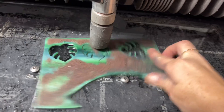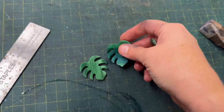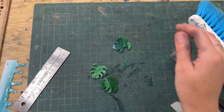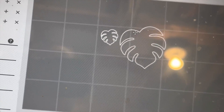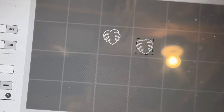These cuts are exactly what I wanted at this scale. The hole is still a little weird though, and I think I want to move it, so we'll do that. I'm doing a test here to see how delicate the glass is with the hole in it, and since we got a break when I was goofing around, I'll need to solve for that too later. I'm going to cheat the system by manipulating the Wazer to slowly pierce the glass instead of cut a tiny hole. This way it'll be one circular shot from the jet of water instead of having a cut-in point beside the hole. I'm doing this by leaving just a couple of extra nodes in my design. I learned this technique by doing it accidentally in the past.